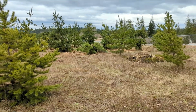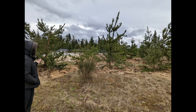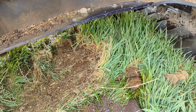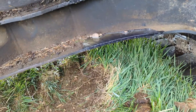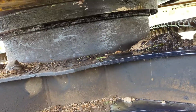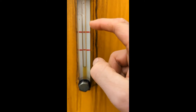My wife calls this the murder forest because I was transplanting trees with my excavator. You can see her with her hand raised in a little frustration at the crookedness and broken trees. While I was doing this work, my John Deere 490E excavator sprung a hydraulic leak, which you can see here. The leak was in a pilot line that ran up to the left control lever in the cab. The split actually happened in the back left engine compartment by the batteries, so fortunately I didn't have all this hydraulic oil in the cab — but there was a lot leaking out, as you can see from my gauge here.